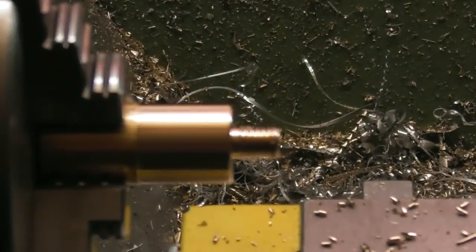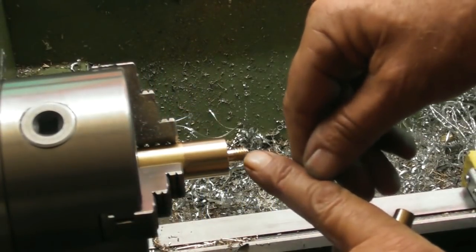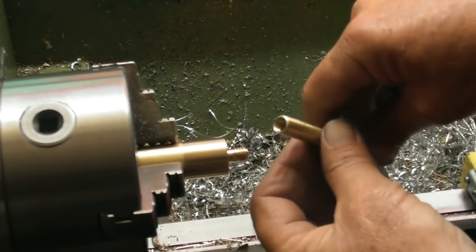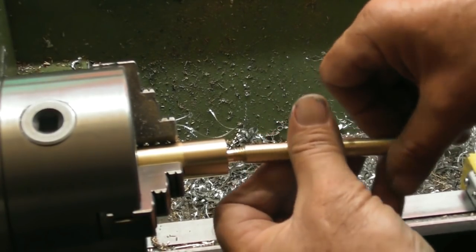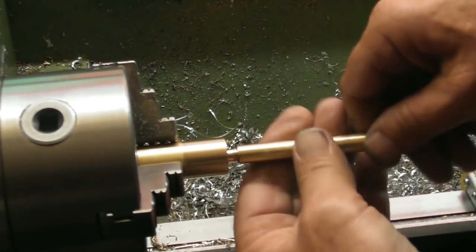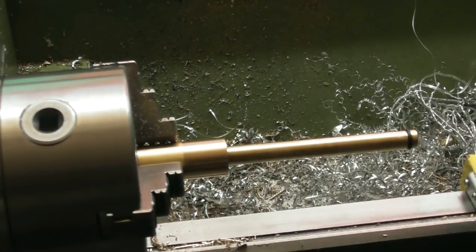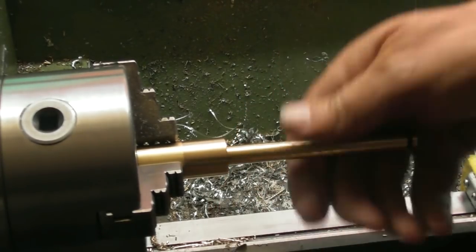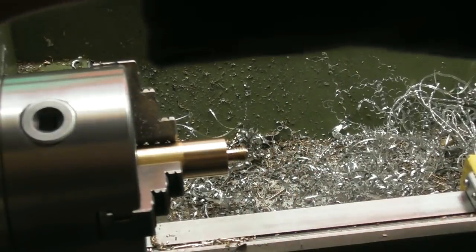Give you a close up of that. Maybe it'll focus. And there we have it. So I've just done a bit of jiggering about, put a slightly larger taper on the end of there, increased the width of the undercut, and I've had to run a plug tap down into the cylinder because the taper tap that I tapped it with wasn't deep enough. Anyway, it screws right up to the end tight. You don't want to do this up tight because you want to be able to access the compartment inside. So that's the handle, fits in there.